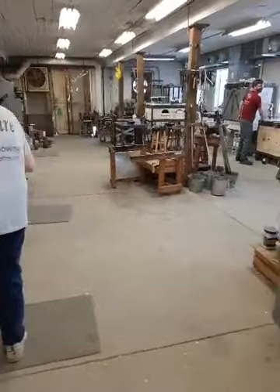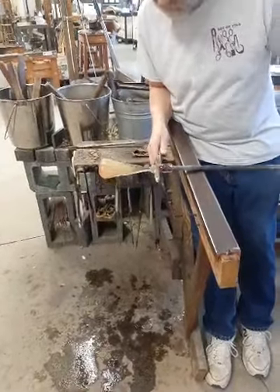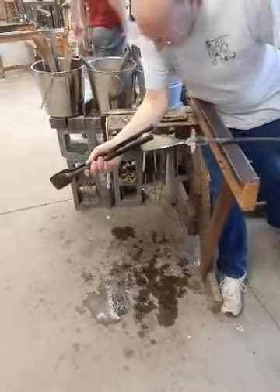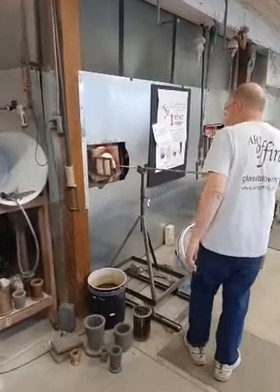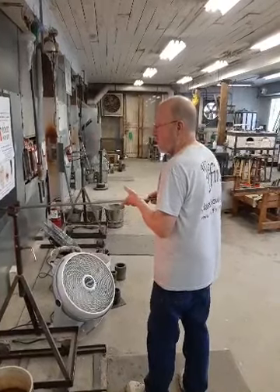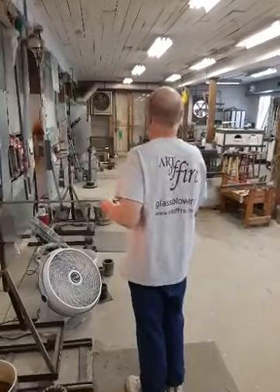Foster has inflated a little bit and is going to need a little more inflation to get things going. He's going to straighten the foot out. Right now he's just making sure it's all centered up with the central axis of the piece — that's why he's using the paddle on the backside by the foot. With glass blowing, keeping the glass centered is probably the most difficult skill. Definitely harder than blowing — when the glass is hot, most anybody can blow glass, but getting folks to learn to center the glass is really difficult.